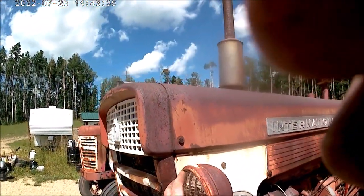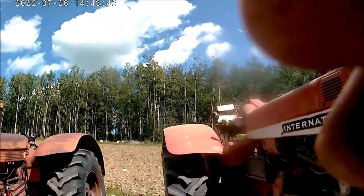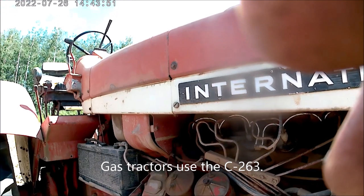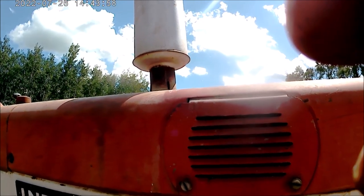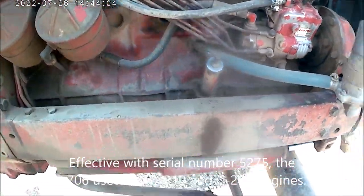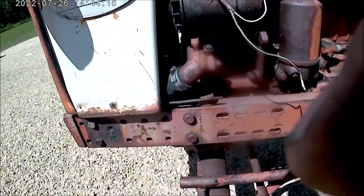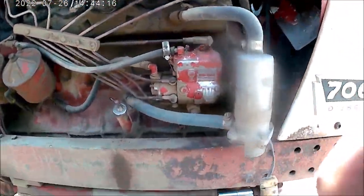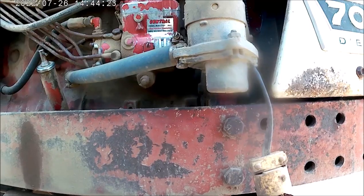The headlights are mounted on the side of the tractor, just like the 450. Now we go to the 706. It too has the D282 engine, just like the 560, but the resemblance stops there. It's got a dry-type air filter — an air cleaner that's new to the tractor. It has a new front axle and a new steering system. The 560 and 450 front axles are very similar, but this is a whole new front axle. This is a hydrostatic steering system, and this cylinder is what turns the wheels back and forth.